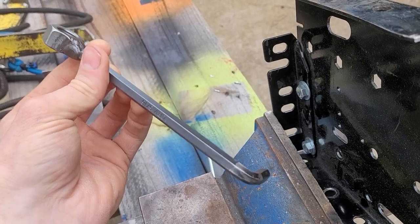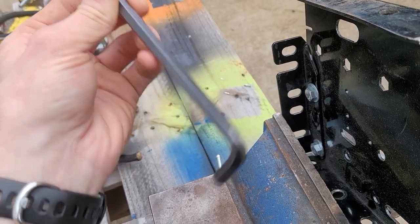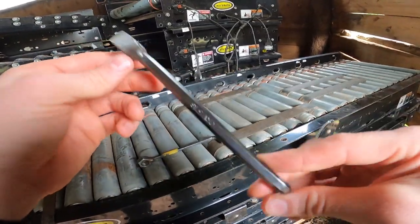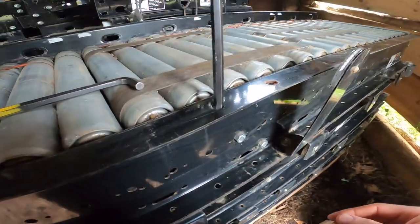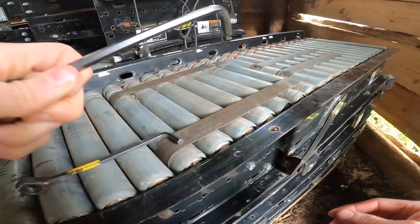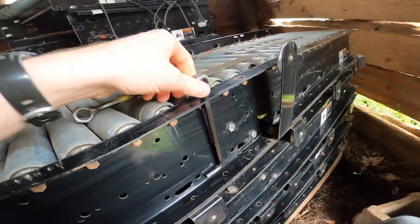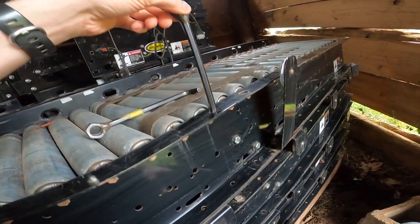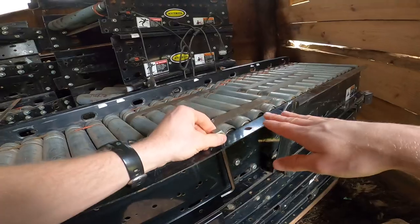These are the simplest rigging hooks, if you can even call them that. It's a 5/16" hex wrench and they just fit in the top of your 3/8" holes on your conveyor and turn 90 degrees. It has to be almost all the way down in order to slip out. This is for when you're picking up a conveyor just a short height to get it off a pallet onto the floor.